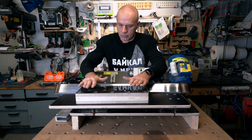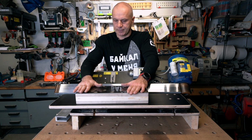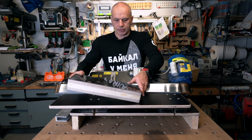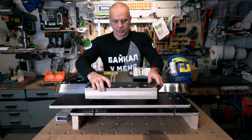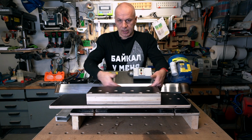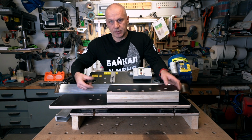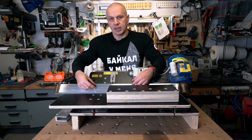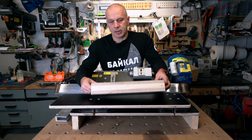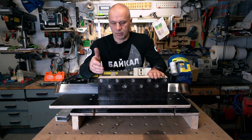So when I have this 5 mm spacer attached with double-sided tape to one of the walls, I make sure that every time I flip my runner in this grip, I go 5 mm higher. On one side I'm sanding on a specific zone on the sanding belt. When I flip the runner, I go 5 mm higher and I use a completely new part of the sanding belt. So having the spacer is way easier for me, and I also recommend you do the same.